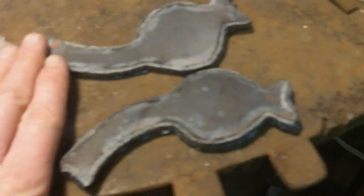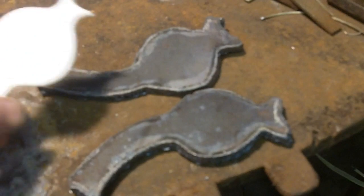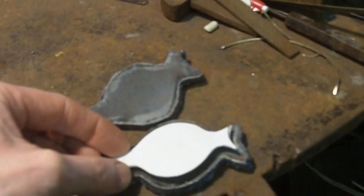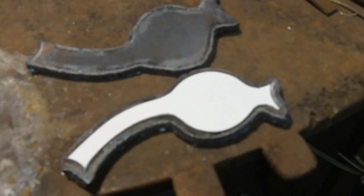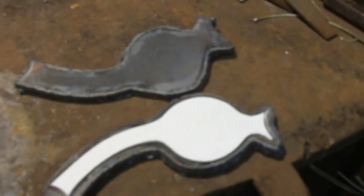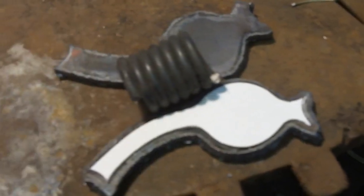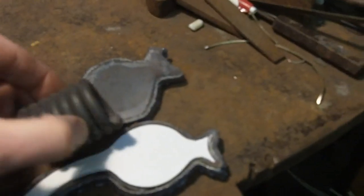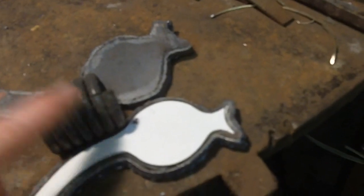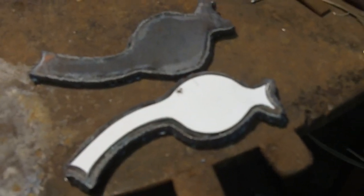The next thing I'll do is clean the top surface off on this steel, then come back and use a scribe to mark my pattern around the edge and grind down to the line. I've also got a coil of one-inch rings here that I need to cut with a hacksaw. I'll have four rings and I'll go ahead and heat those, flatten them, and get those prepped.